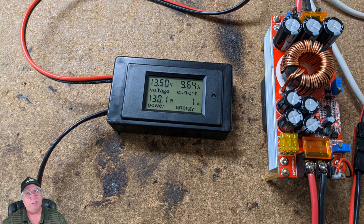Anyway, I want to share that because we're supposed to know this. I've got 8-gauge wire running from the battery in the front of my car about 20 feet to the radio in the back, and I still have about seven-tenths of a volt drop — but that's acceptable because when the car is running I'm putting out about 14 volts. Anyway, there you go. This is Stew AG6AG, 73 for now, hope to see you real soon.